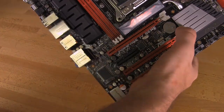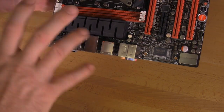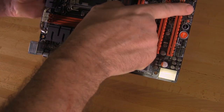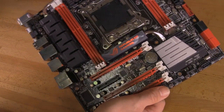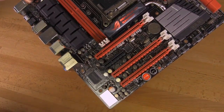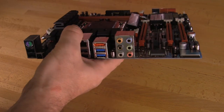Looking at the rest of the board, ASUS has maintained its commitment to have at least four 4-pin PWM fan headers. You have one, two, three, four — and you actually have five on this board. Having more than four is a really nice feature, and that goes with a lot of their controls that allow you to manage those fans.